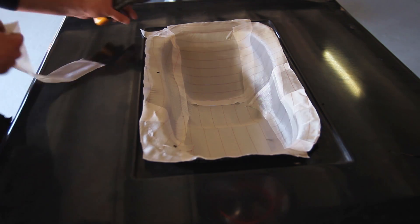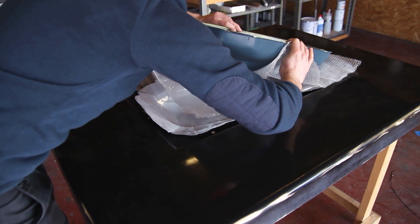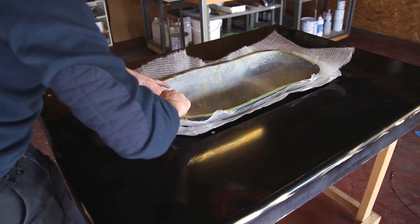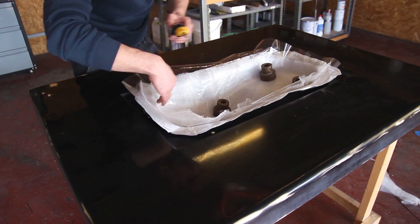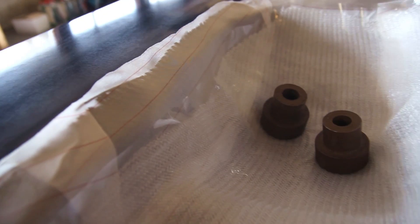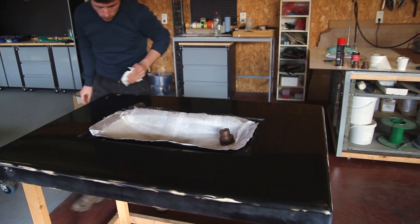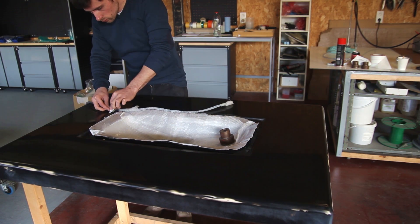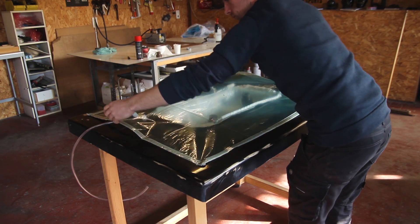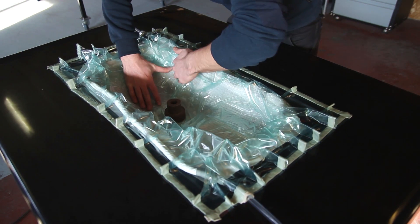The next phase is to apply the peel ply, which gives a nice rough finish on the inside of the part, making it easier to bond other materials to the back. It also makes it possible to remove all the vacuum supply on top — that being a perforated film. Then I've used a 3D knitted infusion mesh because it lays down easier in these kinds of shapes. The infusion mesh comes on top of the flange, and on the vacuum side it sits more inside the part, creating a resin break during infusion — you'll see that later while the infusion is running.